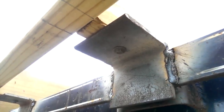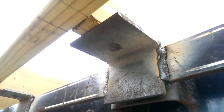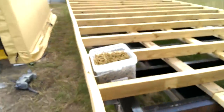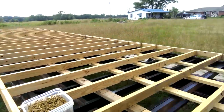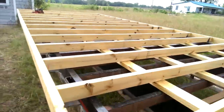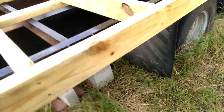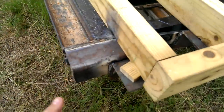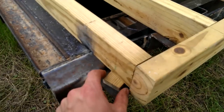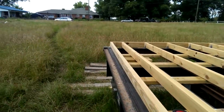I have one of these coated zip screws — they're about 3 and 5/8 inches long so they go fully up into the 2x4. The deck is adhered down on all sides. Down at the end I had to weld on an old 2.5 inch square angle iron to extend it out so I could support that corner better — it's just a little spacer piece. The corner is completely supported on both sides.